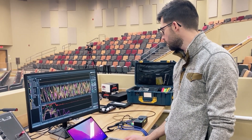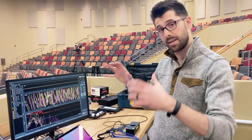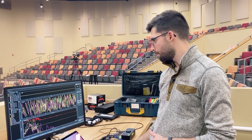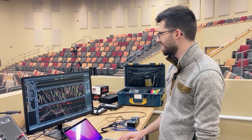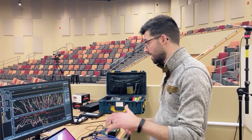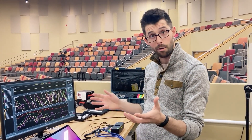Rattling through the other microphones — good coherence on B, C falling a little bit with a weird dip in the middle, which I think is from sound bouncing off the upstage wall and coming back into the cavity with the sub. Microphone D at the very back has coherence that isn't amazing but still pretty good. Above our sub range the data gets pretty rough, which is expected in a reverberant room with multiple subs. This is also assuming the DSP had the subs already aligned to the mains beforehand — we don't have access to the DSP today, so we're working backward from there.